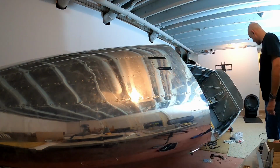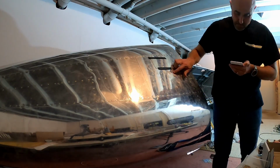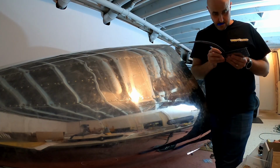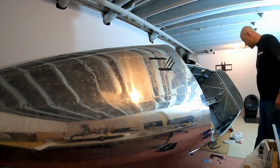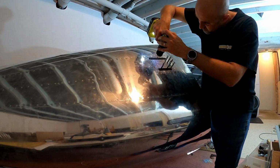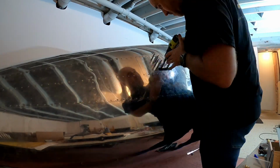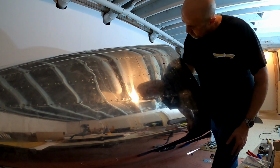I don't plan to use that. I'm not installing the GDL51 or whatever it is that lets you receive XM radio and weather. I'm okay with that. I may change my mind later. We'll see. But for now, it's just going to be for the G3X. The GA36 GPS is a WAAS GPS antenna. It has different tolerances, and that's what we'll be using for the GTN 650 IFR Navigator.